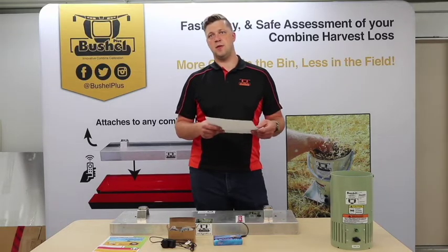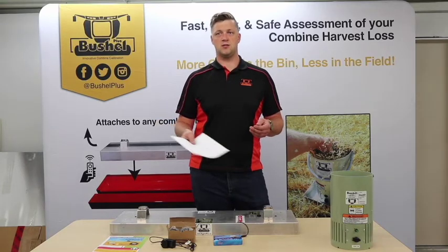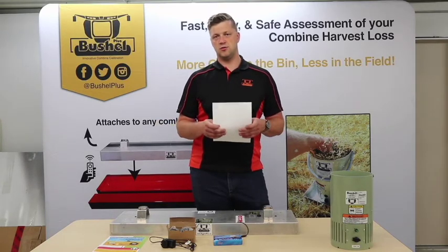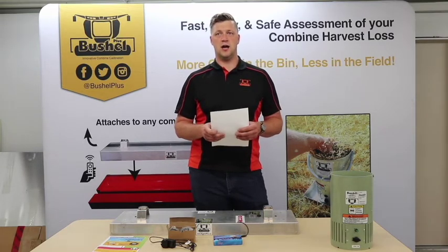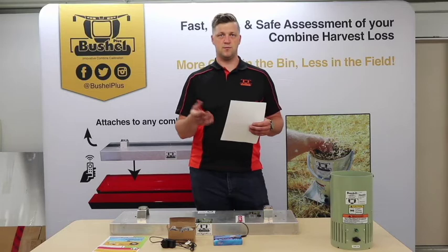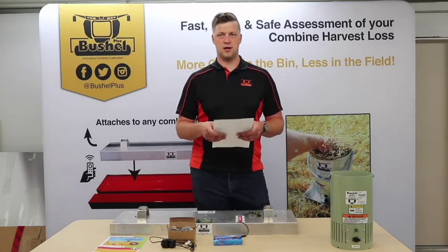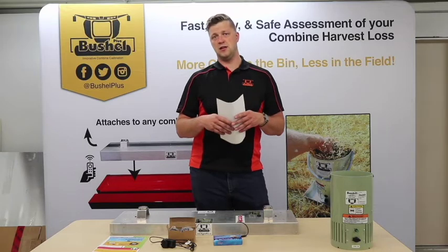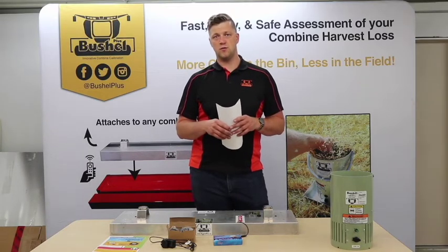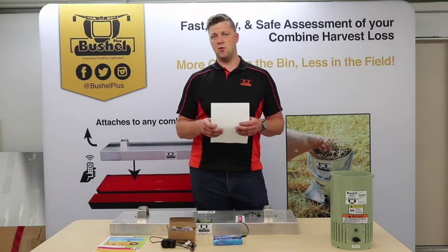And then dependent on stubble conditions, that would determine whether you use the rear axle or under the feeder house. So the feeder house would be useful if you have longer stubble conditions. That way the drop pan is protected from longer stubble and won't get dislodged from any windrow or longer weeds or stubble that are under there. Please note though that the feeder house is generally only wide enough for the 40-inch system, so if customers are purchasing the 60-inch system, then they won't have that option.